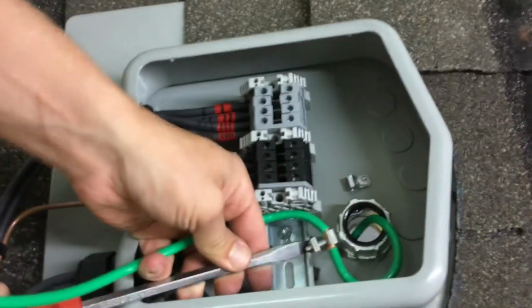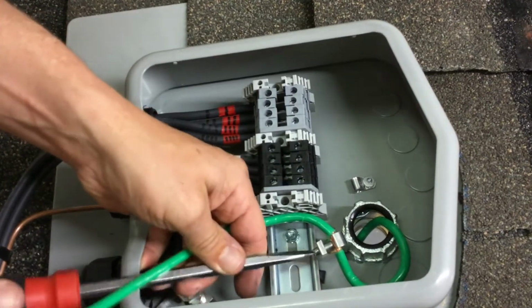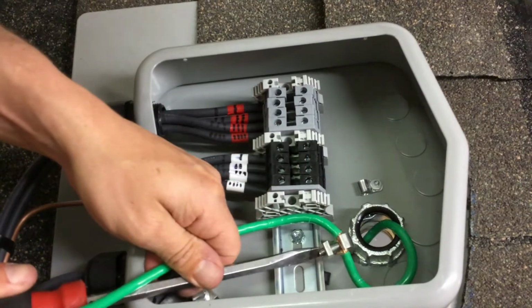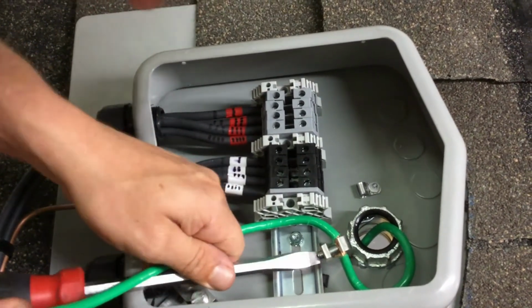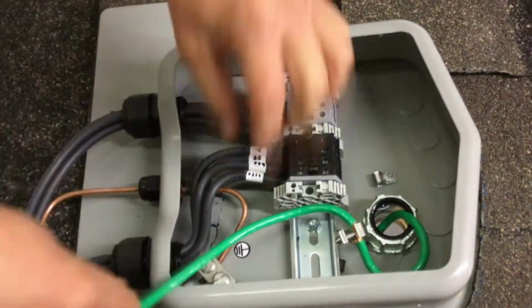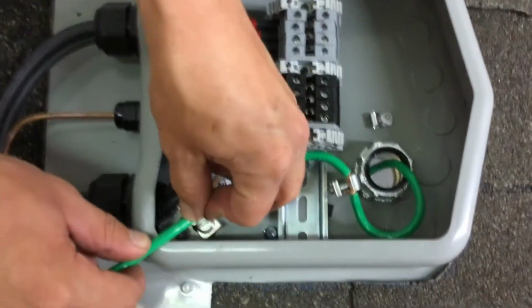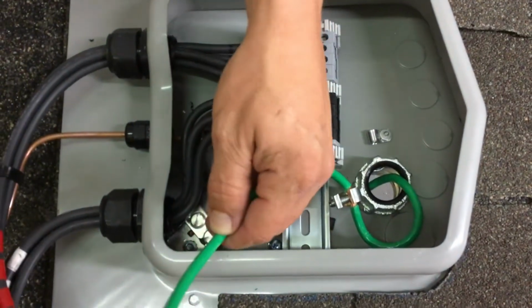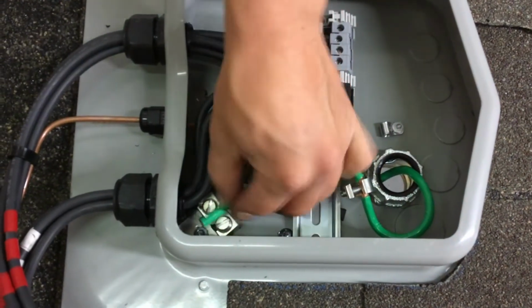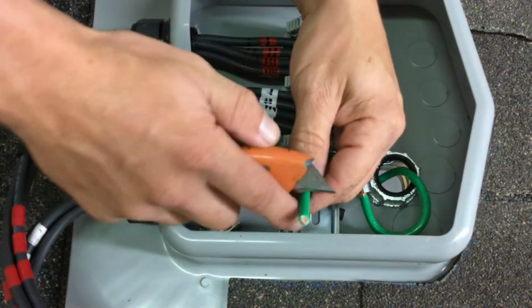And as you can see, bonding bushings are very difficult in a SOLADECK, but you want to get them very snug, otherwise they're not doing what they're intended to do. So take this wire here and kind of gauge where you're going to cut it. Then you can size it up. You can actually put it in there without putting the lug in. Alright, that's good.